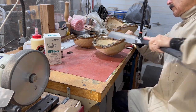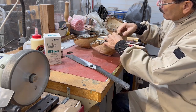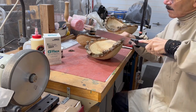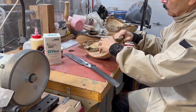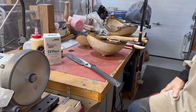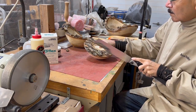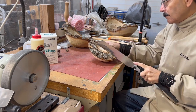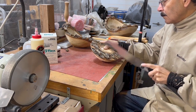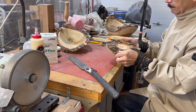The first problem I had was retaining the bark. On the two smaller pieces the bark was almost completely off on the entire half of each piece. So rather than try to put CA glue there, I actually took that whole bark off and I'm just going to glue it back on so it stays on more permanently. That was the medium-sized piece; this is the smallest piece and it had the same problem. The larger piece in the background — the bark was only loose in a few areas, so in that case I just filled it with wood dust and CA glue.